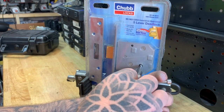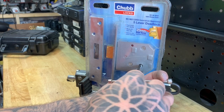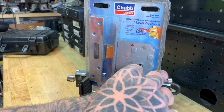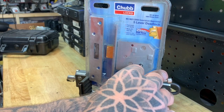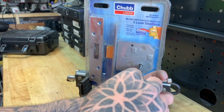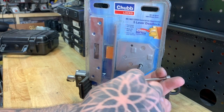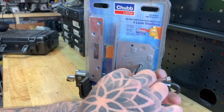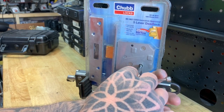Okay, so we've gone into anti-pick. 1's tapping. 2's bound solid. 3, 4. So 3 and 5 are the same. I'm happy with them. They're tapping in the same place. So we've got position 2. Can I lift out a bit? And I've dropped some. Okay, so 2's a high lift. So aimed with that knowledge.